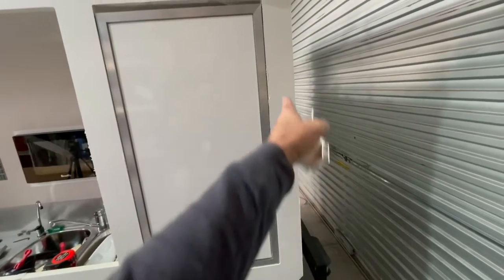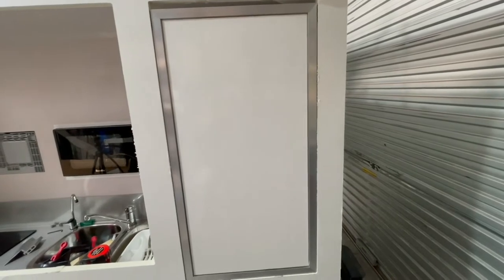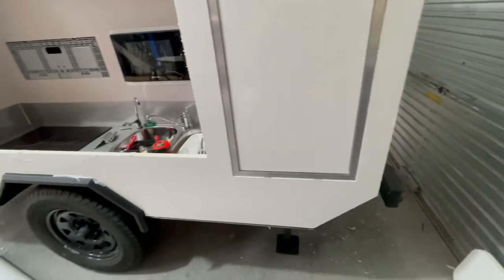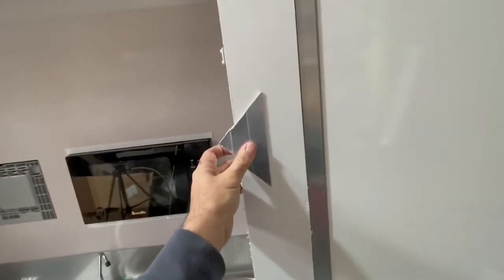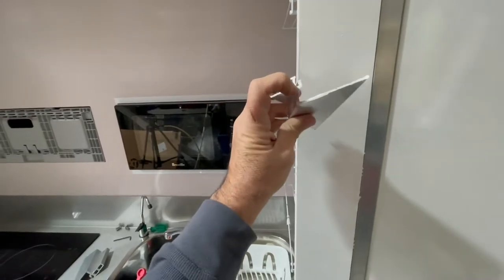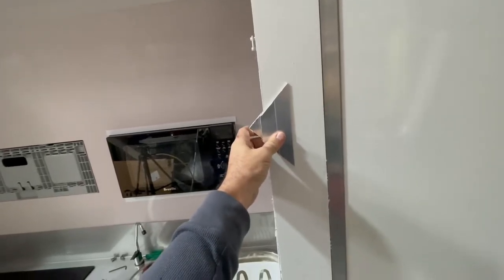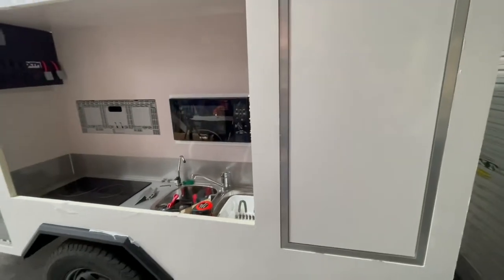No great travesty here - I can just trim 5mm off, probably 10mm looking at that, off two sides. What I'd actually done was, when I calculated it, I'd allowed for these two profiles on either side of this opening to butt into each other so there'd be a straight line through there. But I've ended up with an 8mm gap - 4mm wrong - which is probably that piece there. I'll have to go look back at the profile drawing I got this off on the web when I bought this profile. I'm glad I caught it now, because it could have turned out to be a bit of a problem later on.